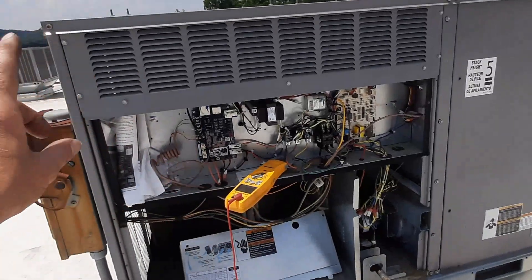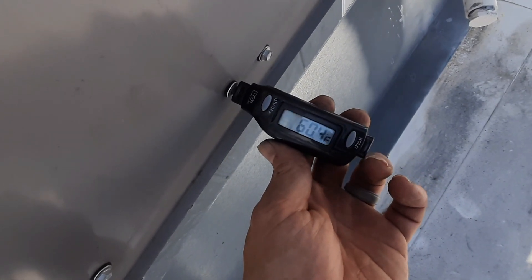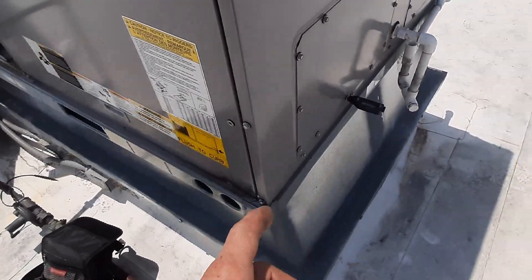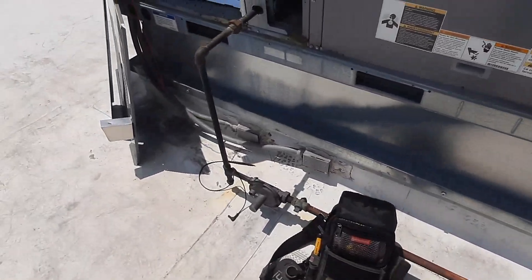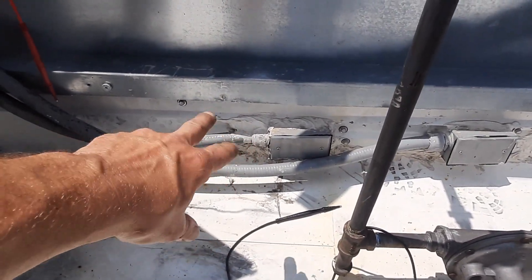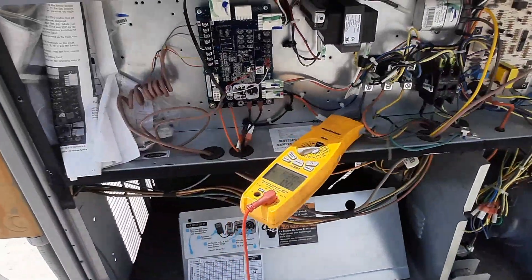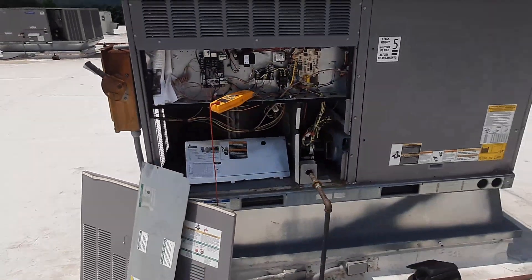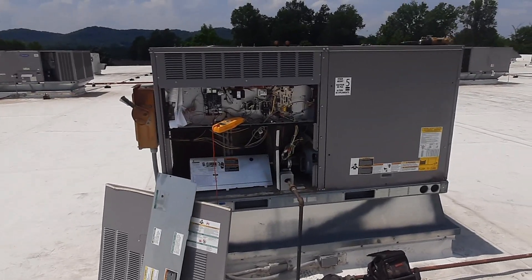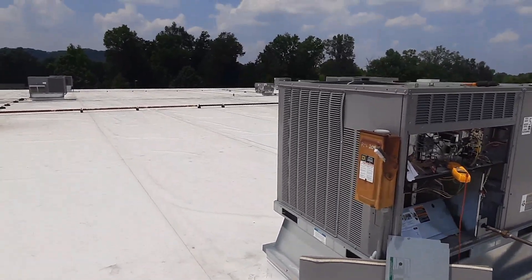They need a new crankcase heater and a new disconnect. We just evened out right at 60 degrees supply, so that's a 20 degree temperature drop. All my zones were calling. I found the one zone that wasn't actually calling — turns out it was in an unoccupied office. The wires in here looked okay, nothing burnt up. We had three phase confirmed, so that's the biggest thing. Easy call I guess — I wish I had an absolute answer on what caused the breaker to trip, but sometimes you don't. We're gonna watch it a little bit, make sure nothing crazy happens, and then get out of here on to the next one.